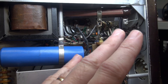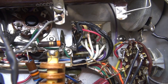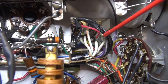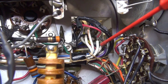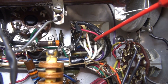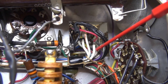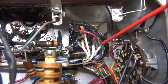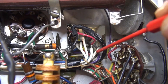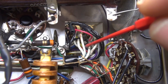The last connection is pin 6. If you're referencing an older Ranger manual, you will not see any reference to clip 6 of SW4 wafer A. In my diagram you'll see that I am using clip 6, because in later Ranger manuals they decided to connect to that so it shuts down the screens of the output tube. This white wire with a green stripe goes back to pin 3 of your 6146 and a 30K resistor - you need to connect to that. I removed some of the insulation and the red wire from my K1 module solders to that. Now all the wiring is complete.